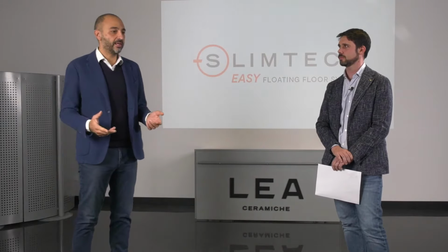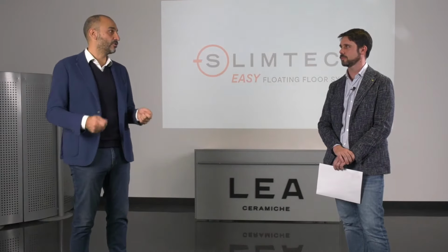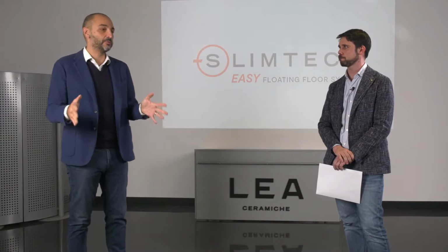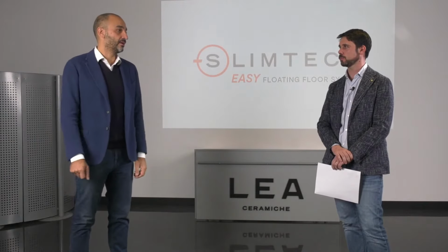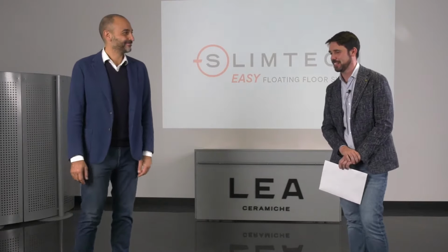If you want to solve the inspection issue, since you have, of course, to remove the silicone and to relay tiles, what you can do is to create some preset inspection points so that they can be used for this purpose. Excellent. Thank you, Marco.